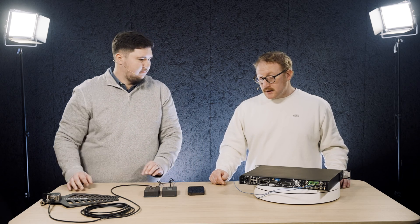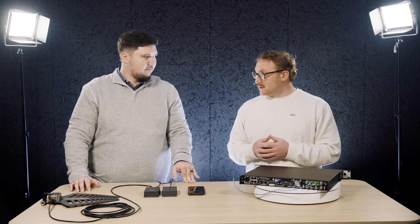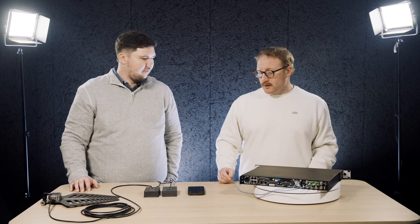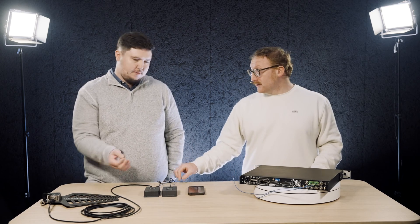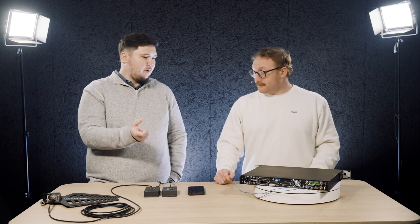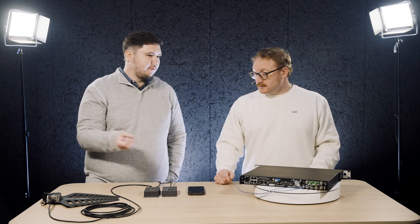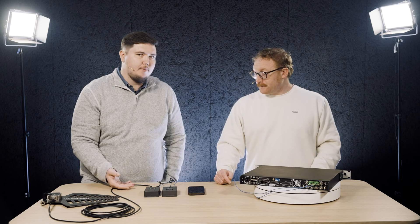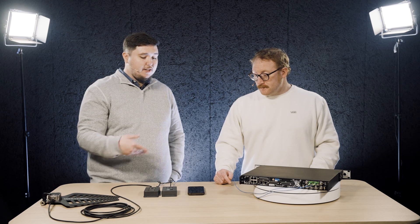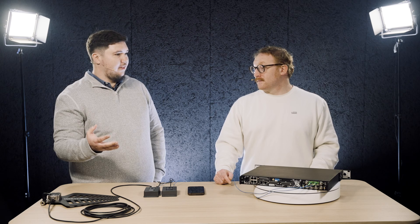And that means single mode with single mode, as compared to multi-mode. There are a lot of small details, but once you get into it you realize: get the correct cable the first time and you'll be rocking and rolling. Which leads into our second point — your RF optical levels.